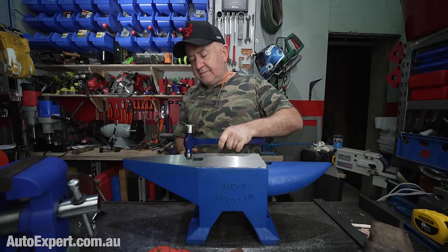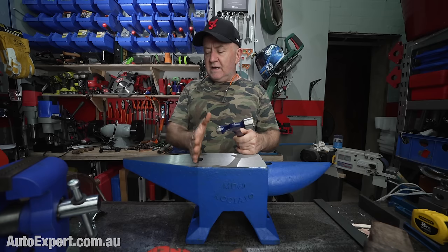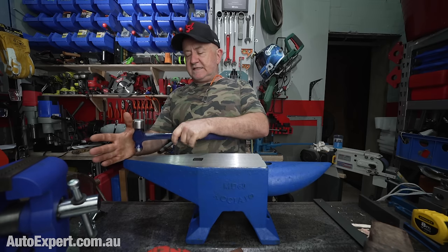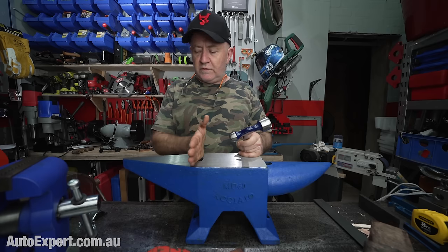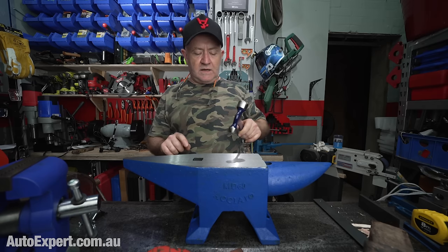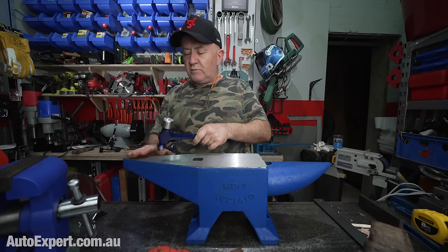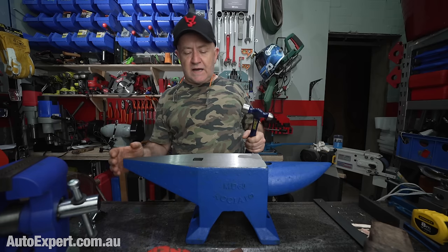And obviously, as you move out here, the tone and the rebound changes, but that's a function of the cantilever and the inevitable resonance that you get from being so far from any visible means of support. You're a long way out back here, therefore that feels a bit more dead than here or here, but this is where you're going to do most of your work, and this is only ever going to be for light work anyway, where you bend something or straighten it out, whatever, over a sharper edge.